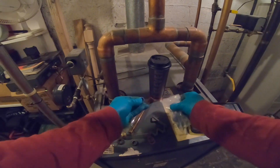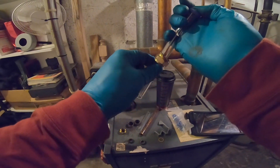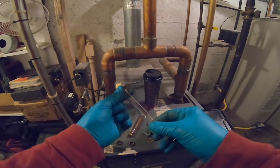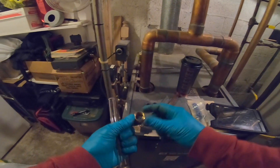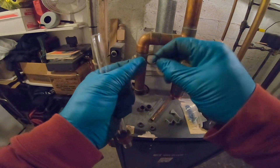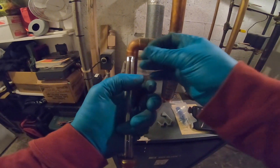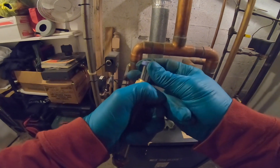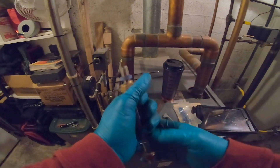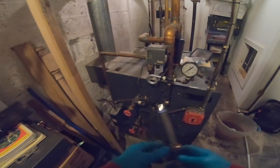Two new washers — your ferrule and your washer. There you go, that's for that side, now for the other. Like I said, these are dirty — you got to brush them and clean them good, or just swap them. I don't mess around with these. They could be reused, but I just pop them in along with a new gasket. Be careful — glass is sharp, so don't play around with that. I've got gloves on, but they slice and dice so easy.